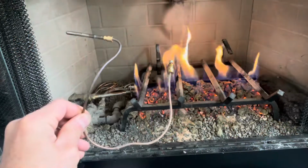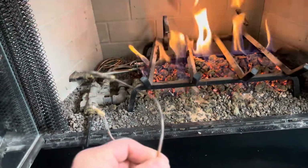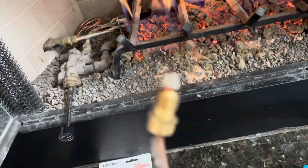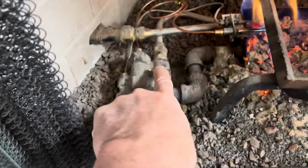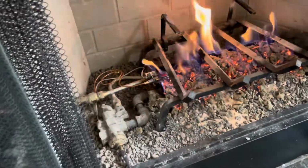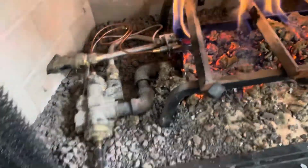Thanks for watching. If your fireplace turns on and then turns off, it's most likely your thermocouple. And this is what this looks like. We got a little thread thing right there where that goes into this area over here. That thermocouple is defective, so you need to buy a new one. They're about $8. You can get them at the big box store.